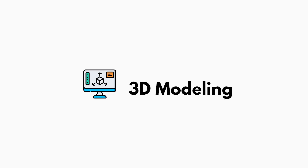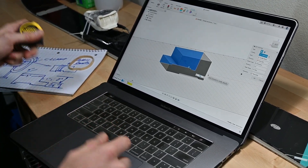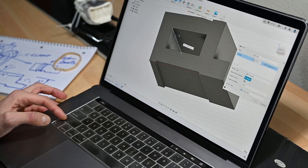The 3D modeling portion was actually very simple — we had the design, we knew what it looked like, and all we had to do was put it into Fusion 360. Good thing Max actually does this for a living. There were two main things we focused on: first, minimizing material by putting a large hole in the middle of the ski vise, since that extra material is a waste to print. We also took a stress analysis class in college where they would drill holes in the middle of everything, so we figured it was a good approach. Second, we made sure there was enough material in the clamping area so it wouldn't move, crack, or break.